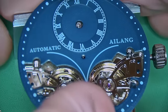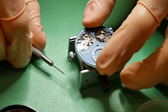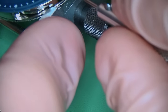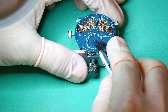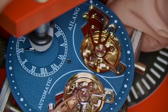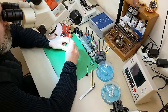I'm offering the dial to the movement, loosening the screws on the side to press it on correctly, then nipping them up nice and tight. Once done, I move on to fitting the hands — there's no date complication so I can pop on the hour hand wherever I want, then line it up to 12 o'clock and press it down with a hand press tool. All friction fit, pretty straightforward. When offering the minute hand make sure you line it up to 12 o'clock as well — both bang on precise — then press that on with the hand press tool.